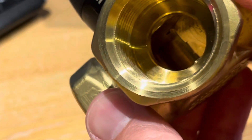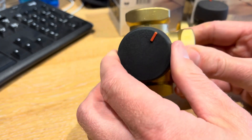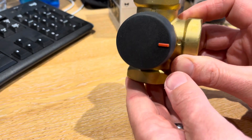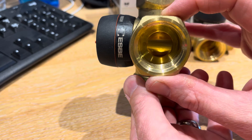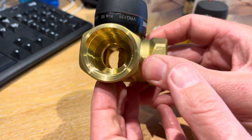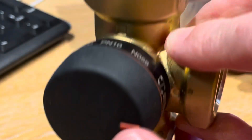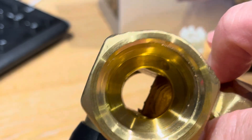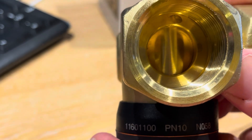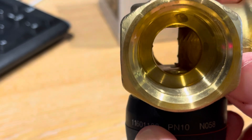The input on the triangle will now go out of the side port. With a 90 degree actuation, if I move that round to the circle, you will now see that the side port is closed — the brass shoe has closed the side port — and the bottom, which was the input from the triangle before, now goes out of the square at the top. You can just about see the shoe in there; as it moves, you can see it covers off that port, and as it moves round, it covers off the other port.